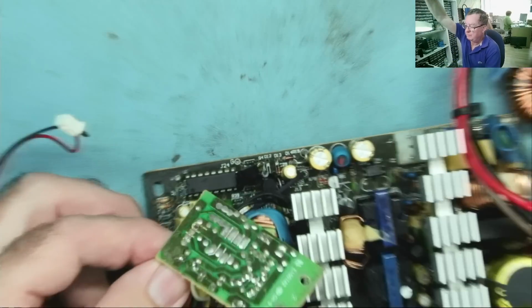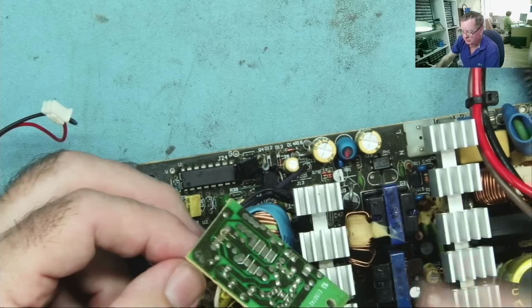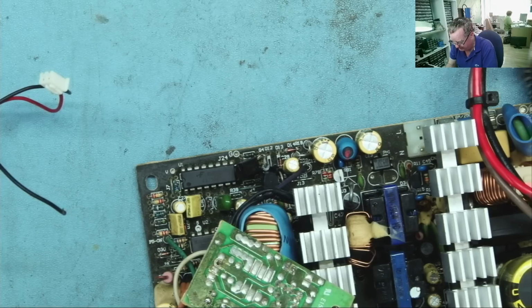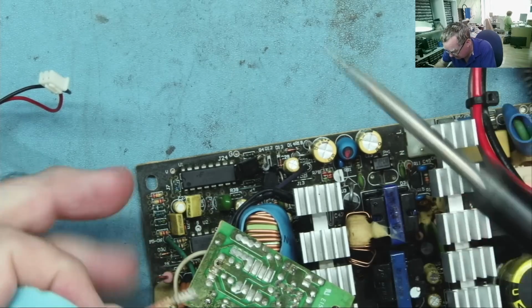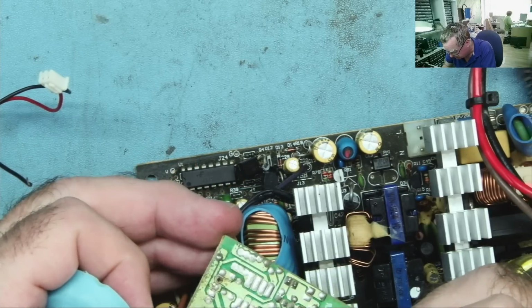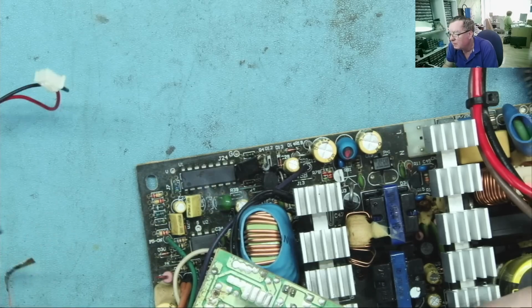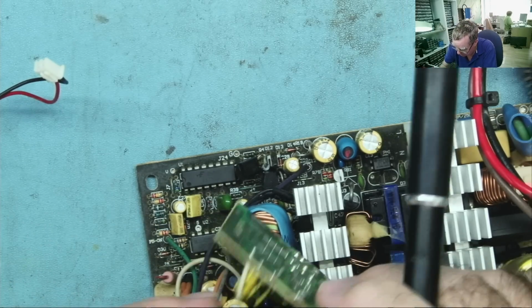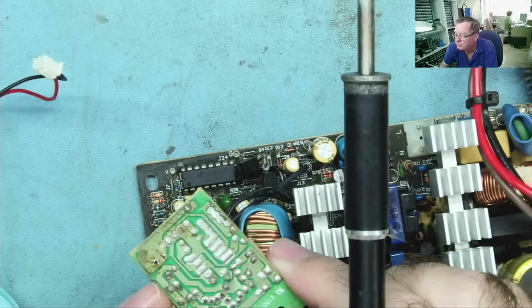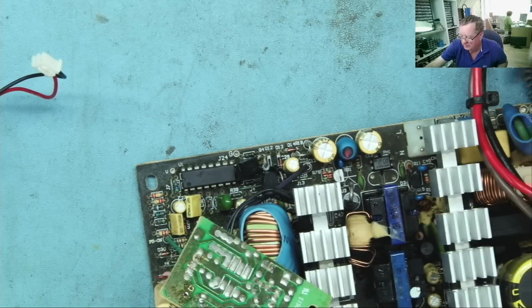has been worked on before. And you see where I had to desolder this last time. So we'll just do that. When you're doing this sort of thing, I find it quite useful to get a bit of braid and clear the hole, so it makes it easier to see where you've desoldered stuff from, basically. Of course, I've desoldered 2 holes, but they are connected together anyway, so that doesn't really matter.